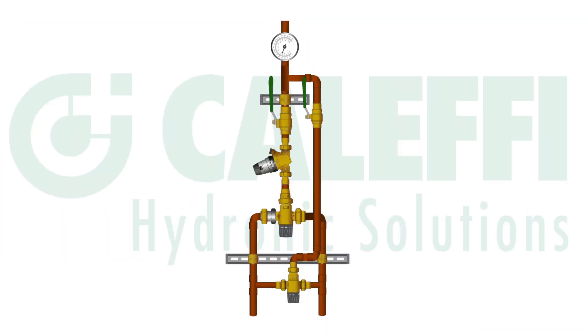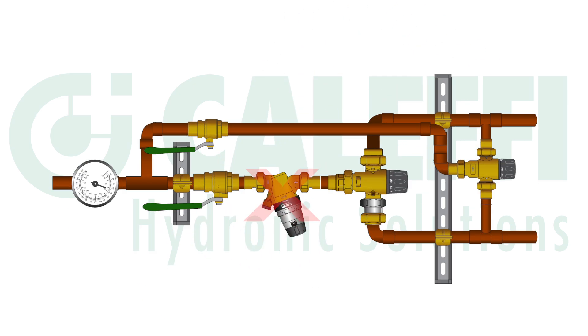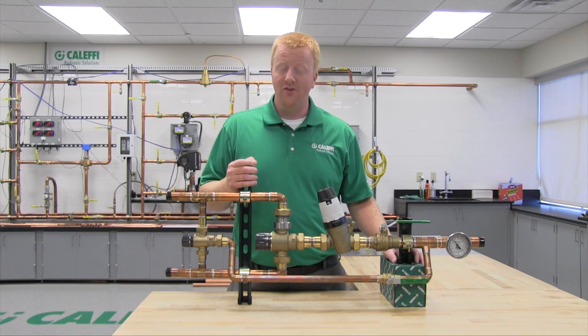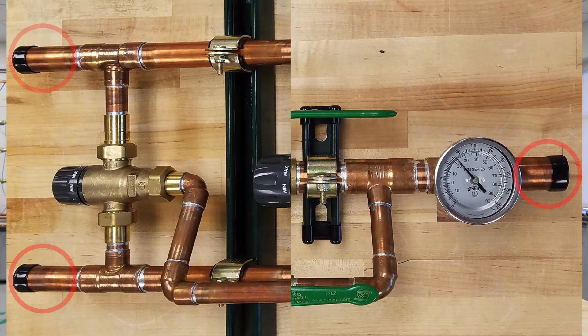Now let's talk about installation. The unit must be mounted indoors — it cannot be mounted outdoors. There are really no limitations on orientation; it can be mounted in vertical or horizontal pipe. The only limitation is that the body of the pressure reducing valve must be above the pipe it's mounted in, to prevent debris from getting inside and limiting its operation. When mounting the assembly, make sure to grab a friend as it is rather bulky. You can use standard lag bolts to mount it to wood or any type of anchor depending on your surface. Then make your sweat connections at the inlets and outlet, open up flow, and check for leaks.